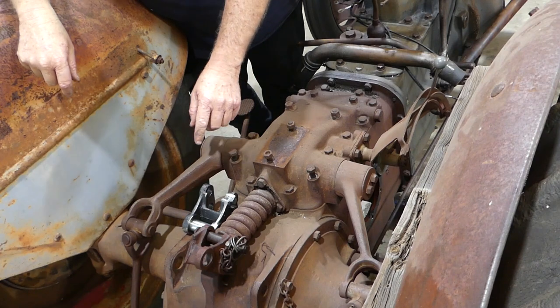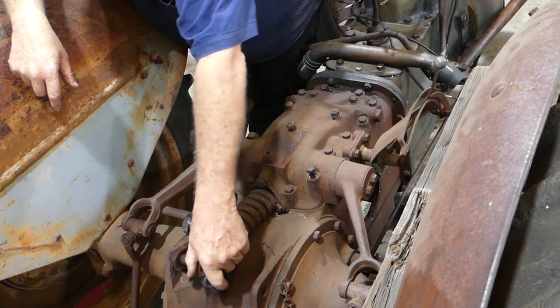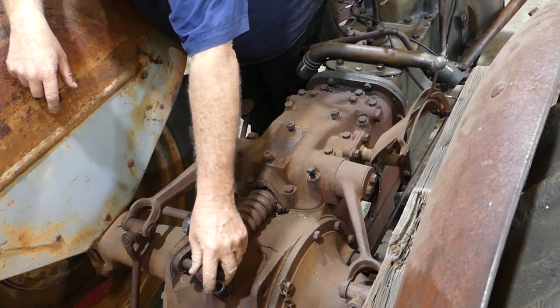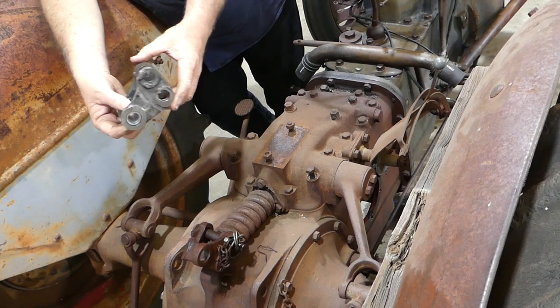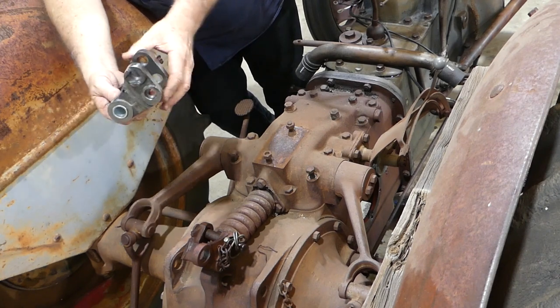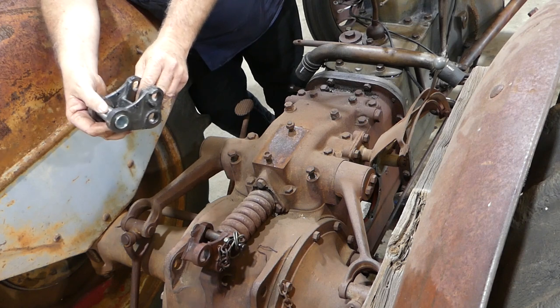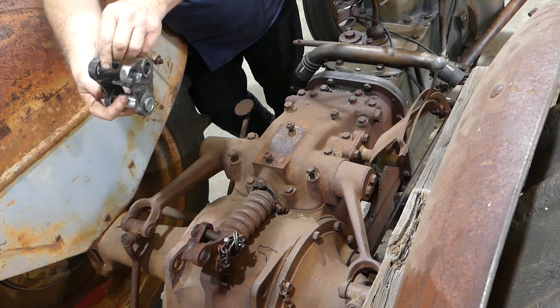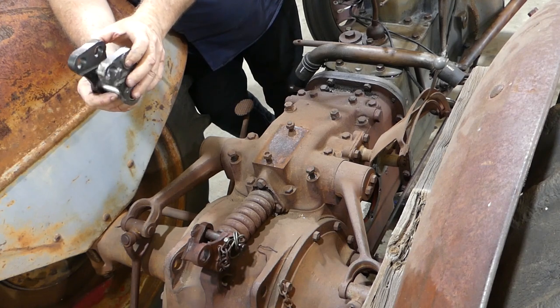To start off with, this link here is your draft link - it looks like this. There's a pivot pin going through the housing and it pivots on there, sits like that. Your top link goes in here and your spring goes there, so that pivots back and forth.